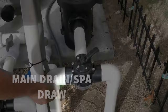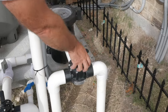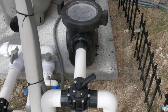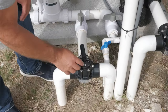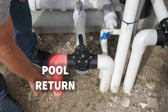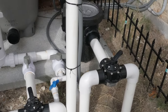Essentially, you're doing two things with any body of water when it comes to a recirculation system. There's a suction side — that's what we call the inlet — and then there's the return side, or what we call the outlet. On a spa pool combination, we're determining which water comes from and goes to which place.